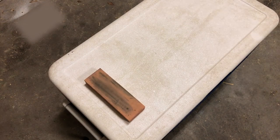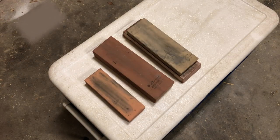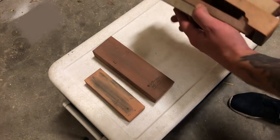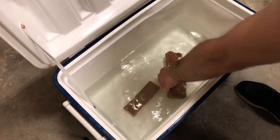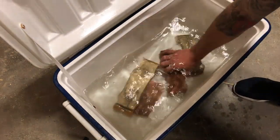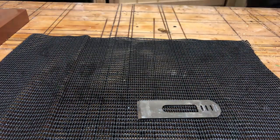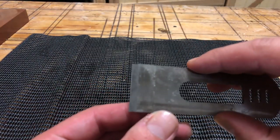Hello friends and followers. Today I'm going to be sharpening my little block plane. This is a 13.5 degree block plane — it's really good for doing end grain. I use it a lot if I'm going to be doing some faces on cabinet shelves and drawers. It really helps you get a really nice clean gap all the way around each shelf and drawer.